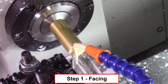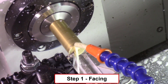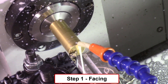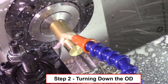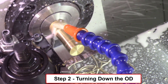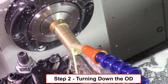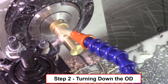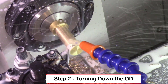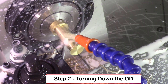This section of the video shows the actual machining using coolant. The use of coolant can be a little sloppy but it keeps the parts and tools cleaner and cooler and provides for the best finishes on all my parts. I did speed up this section of the video by three times the actual machining time for viewing purposes, but I did remove the time for tooling changes. The actual machining time for machining each brass bearing was about six minutes, which includes changing each of the six tools for each machined part. So about half the total time was just for tooling changes.